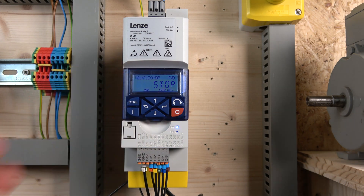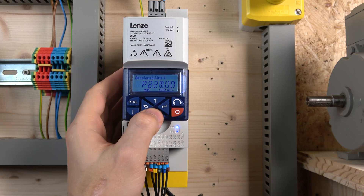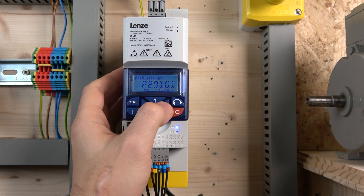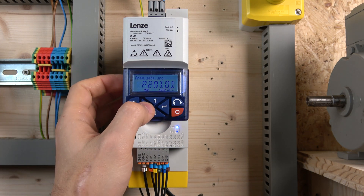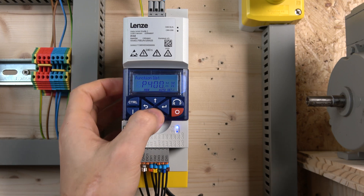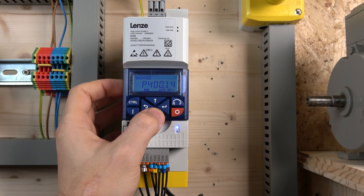For the MOP setup, as you can see there's already MOP shown on the drive. I went ahead and reset it. To set that up, go into the frequency mode parameter and scroll through until you see the frequency selection option — set that to MOP. From there we're pretty much done on that one. Now let's jump straight to group four where we need to assign our IOs.